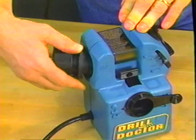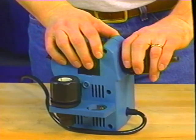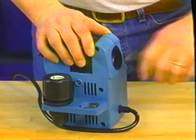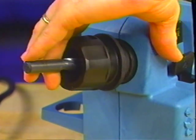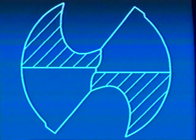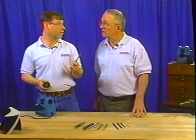After sharpening the drill, with the motor still on, insert the chuck into the splitting tube labeled number four. Align the flats on the chuck with the flats in the splitting port — the cam edge should almost rest on the machine housing. Slowly pull the chuck toward you, allowing the chuck to pivot in the port. You'll hear the drill contact the wheel. Two short pecks should split the point on smaller drills; it may take more on larger drills. Pull the chuck out of the port just far enough to rotate it 180 degrees, push it back in, and give two more pecks to split the other side. The split should be even and symmetrical — the two parallel lines should have a separation of 5 to 12 thousandths on the chisel angle. If you follow these instructions, you'll have incredibly sharp drills.